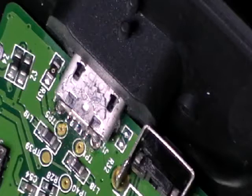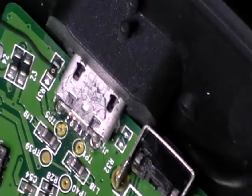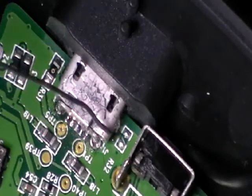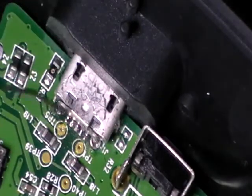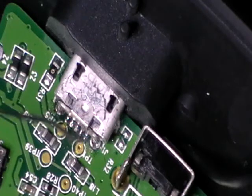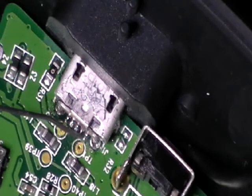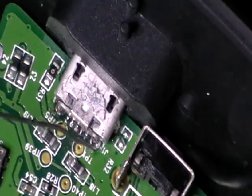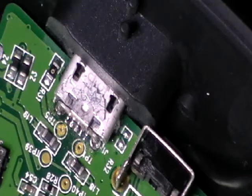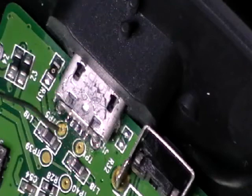I'll include a microscopic shot of it, but it's just a matter of pushing it back into place. These four connectors here aren't very critical and they're fairly easily soldered. These little lanes here — you'd need some solder wick to clean any dirty and old solder off there, then just put a little touch of solder on each lane, put it back into place and run the soldering iron along there. It's something that you really have to have a microscope to do — it's very difficult, as you'll see in the shot later.